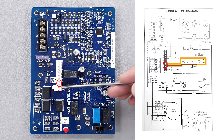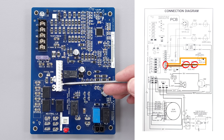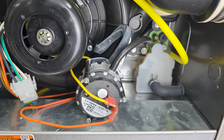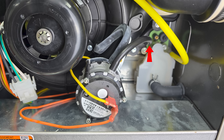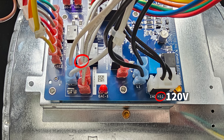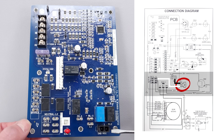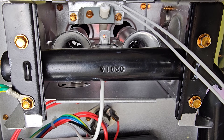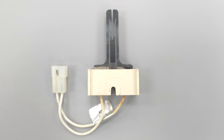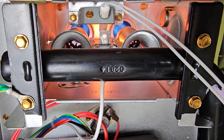Between pins two and four is the low pressure switch, and between pins three and four it looks for both the low and high pressure switch to be closed. But if you just have a single-stage gas furnace, one is connected to the condensate trap to make sure it's not clogged and the other is connected right to the inducer motor housing. Once those two are closed, you're going to have 120 volts applied over to the hot surface igniter - HSI on the circuit board. That's over in the combustion box with a hot wire and a common wire. It's going to turn that hot surface igniter cherry red, and that's either going to be a silicon carbide - the older style - or the silicon nitride, which is like a thin little blade. That's there to help ignite the gas.